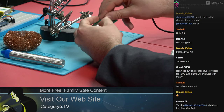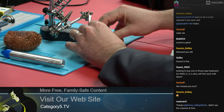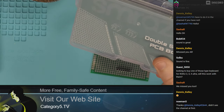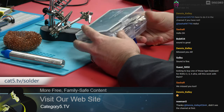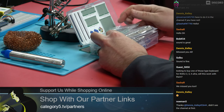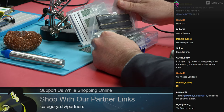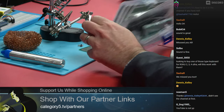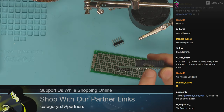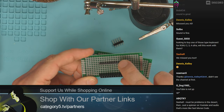My little tip here — one of my little tricks — is to grab yourself a pack of prototyping boards like this. Once you've bought it and opened it, you're never going to be able to close it again. It comes with a whole bunch of prototyping boards and some headers. What you can do with that is grab a little bit of glue and glue a header onto your circuit board, then solder the other edge, the back end, and then do the opposite header. So we've got two types of headers — female and male.